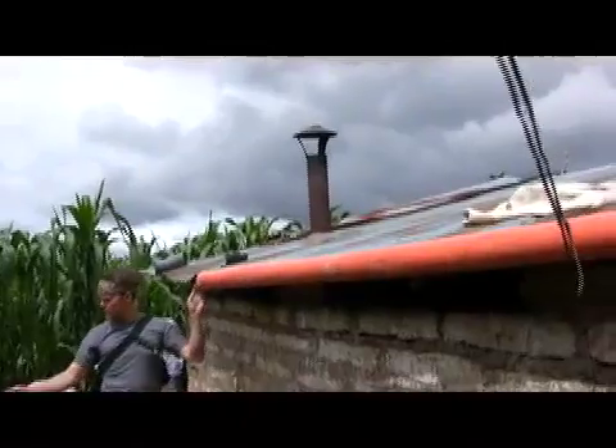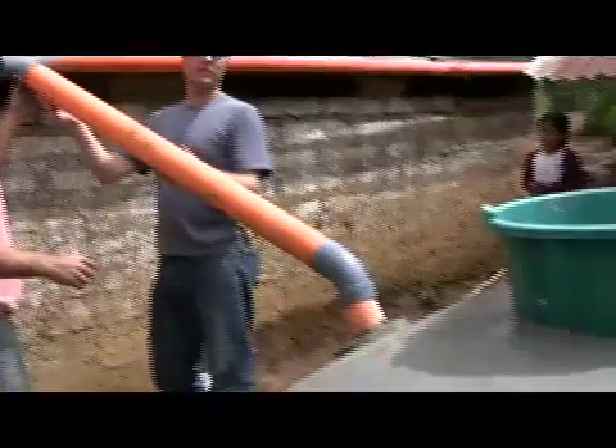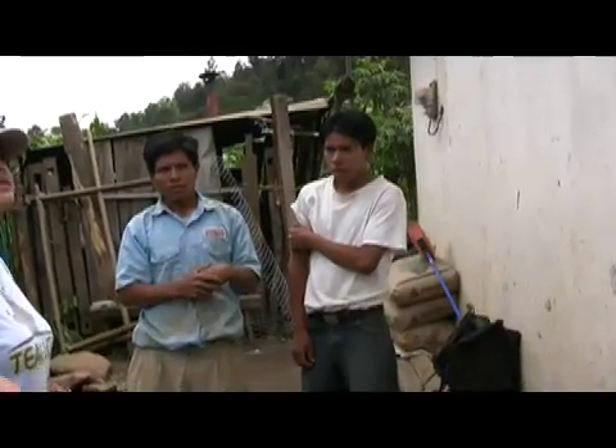We then built out layer upon layer of cement until we had a three to four inch thickness on the exterior dome. As soon as it was done, we worked on the rainwater attachment system, which was composed of PVC piping attached to the roof of the houses. The tubing was then connected to the upper half of the in-ground tank. The tanks are almost ready to collect water. Peace Corps volunteers still there, as well as some hired laborers, are finishing up the work. We couldn't wait in-country for two or three weeks to let the cement cure, so we did the lion's share of the work and our partners are finishing it up.